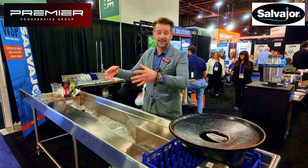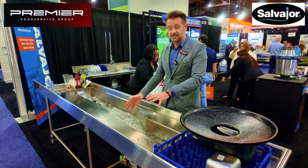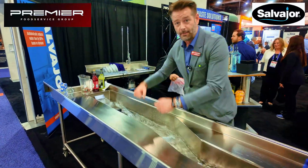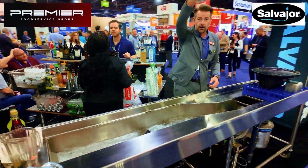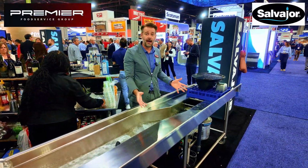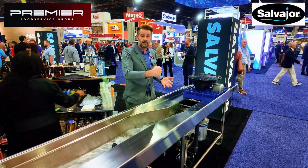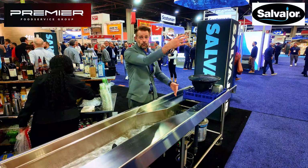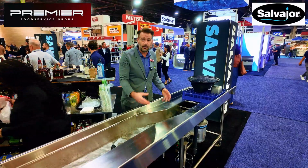Ideally, what you want to do as well is take a stack of plates or a stack of trays, set them down in the flow of water, and that will agitate and do a lot of the pre-rinsing for you. Then you use 2 hands and scrape out going through the water plume here. So you've got 2 hands to rack dishes with, not 1 hand on a pre-rinse spraying over your rack. I'm a fan, if I understand you need to have a pre-rinse. I like to make it slightly inconvenient so that they can go down and use the pre-rinse when they've got to wash out a big pot. But when they're doing their plate scraping, they use 2 hands instead of having 1 hand on the pre-rinse. This will double your scraping speed easily.